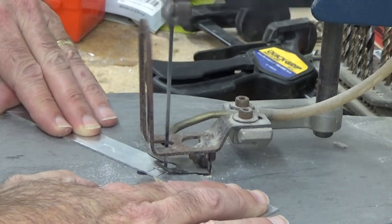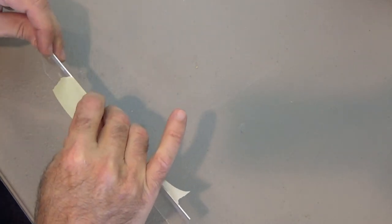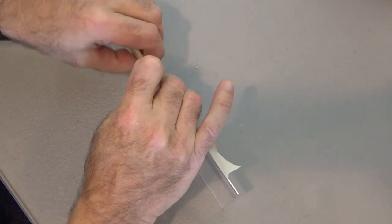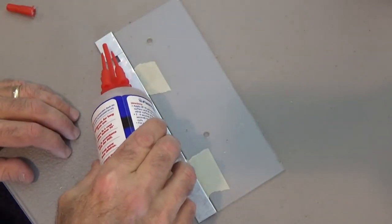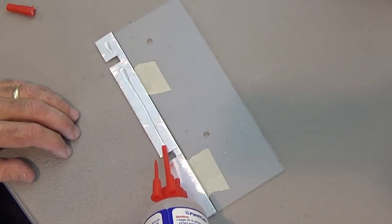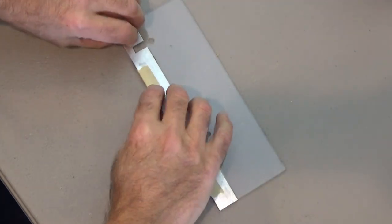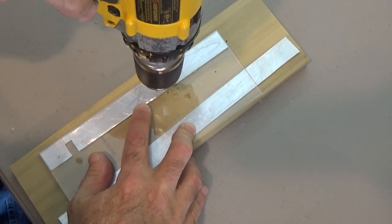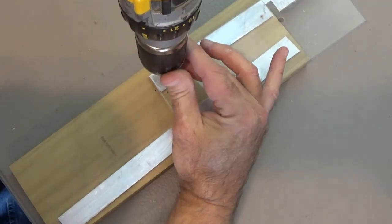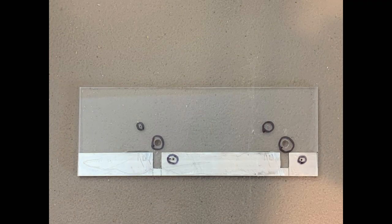Remove the paper template and white paper. Tape the aluminum bar to the top of the sheet with its long edge aligned with the long edge of the acrylic sheet. Mark cut lines as indicated in the diagram, then remove the aluminum bar and mark additional cut lines. Remove the unneeded aluminum from the bar — I used a scroll saw, but use whatever you have. Be especially careful not to cut the bar in two. First test fit the finished bar on the underside of the sheet. Once you're happy with the test fit, use CA or epoxy to glue the finished bar to the underside of the acrylic sheet. Once the glue has set, drill two 1.5mm holes in the aluminum bar using the holes in the acrylic sheet as a guide. The jig is now ready for use.